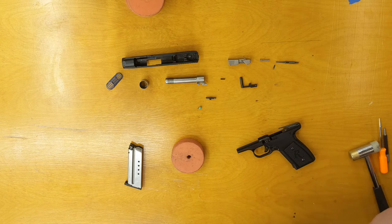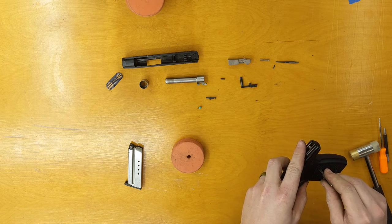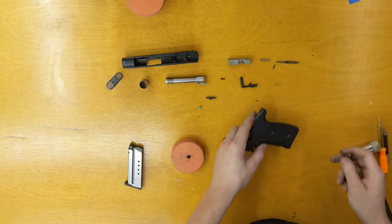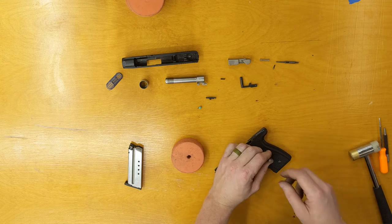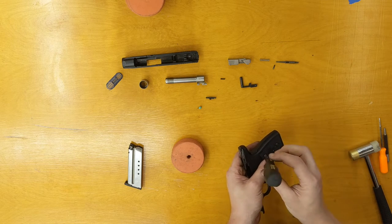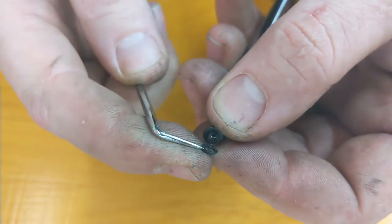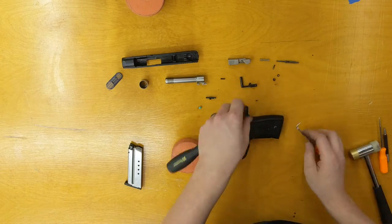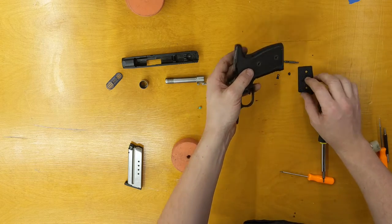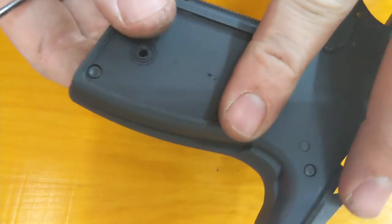Now when you take the grips off this gun, they're a Torx drive — looks like a T15. Under these grips there are two pins that are being held in by the grips. They won't spring out at you, but they will fall out if you tip them. So take the two screws out. The screws have a little rubber washer on them — if they stay on the screw you can leave them on, but if they're in the grips, don't lose them. These two pins can come out when you tip it over, so put a finger over them when you take the other grip off.